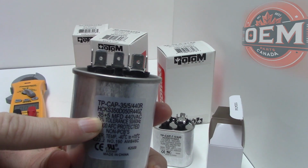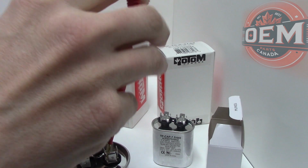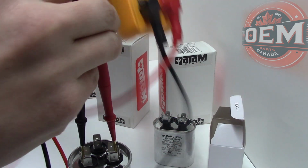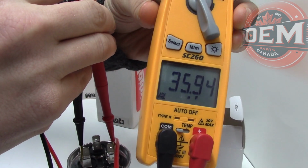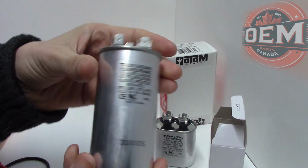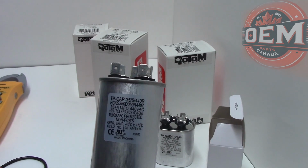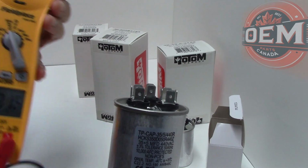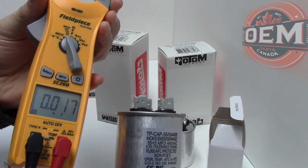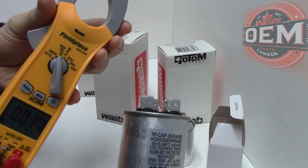But if I want to get my 35 microfarad reading, I've got to go to my Herm to my common, and that's where I'm going to get my 35 reading, as you can see. So this is a good capacitor. Again, you're not going to be able to tell unless you have a meter that can read microfarad. I'm going to put in the description cheap meters that can do that, far cheaper than this one here.